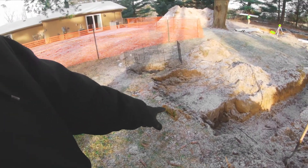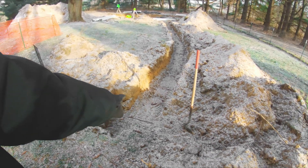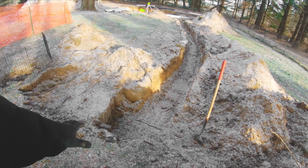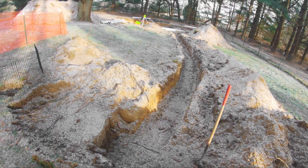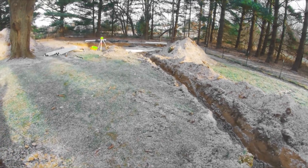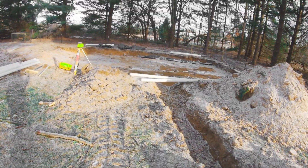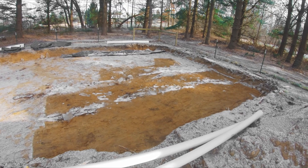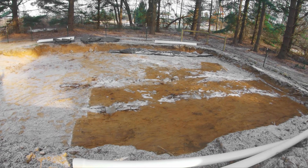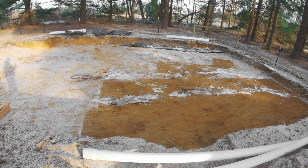We're going to do a quick overview of what that looks like. We've got the septic tank exposed - you can see right here where the pipe exited the tank - and then we have our new trench going down to the new drain field. Code requires you have fall going from the tank to the drain field because water has to flow. The other component that sets our elevation is code requires at least one foot of cover over the pipe out in the drain field, but no more than two feet. If you don't meet those requirements, you have to move into an engineered field, whether it's a pressurized mound system or something like that.